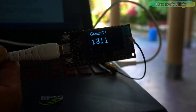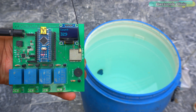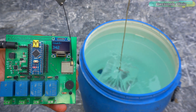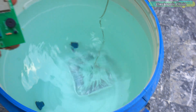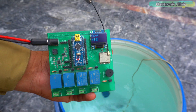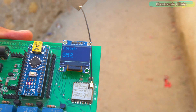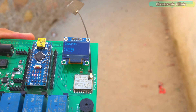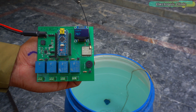Now the 433MHz LoRa transmitter. As per the theory, 433MHz LoRa modules should perform a bit better than 866MHz — let's check it out. It's working as expected. Now we will check the receiver's distance; it should cover a greater distance because of the low frequency and the FPC type antenna. It's still working even after coming behind the wall. Now I have come outside the house — there are many walls in between and the receiver is still receiving numbers. When I go further away than this, the communication stops. If I had used a suction cup antenna instead of the FPC antenna, the range might have been a bit more. So in this test, the 433MHz LoRa modules are the winner.